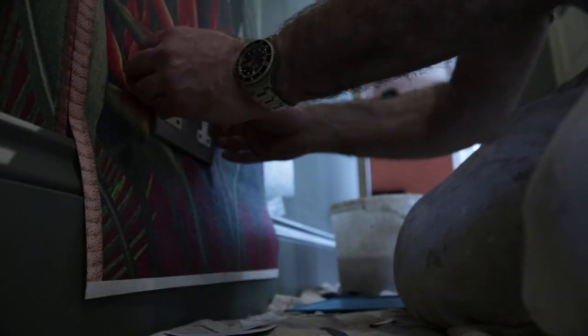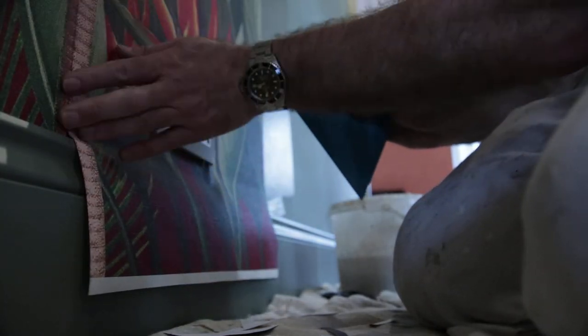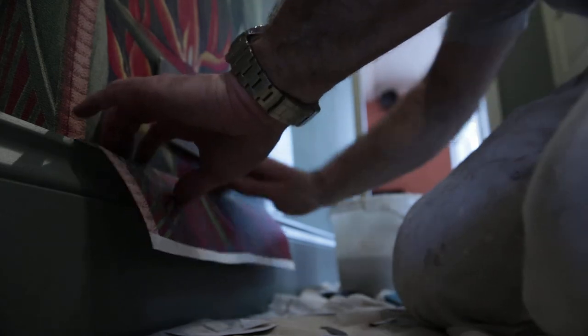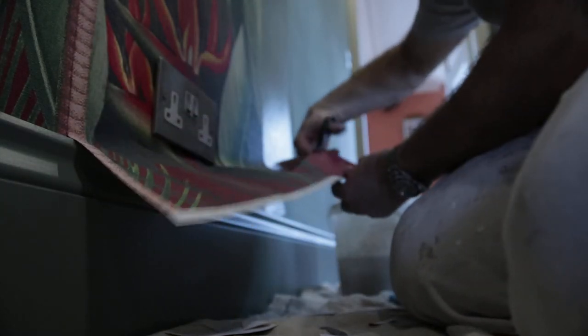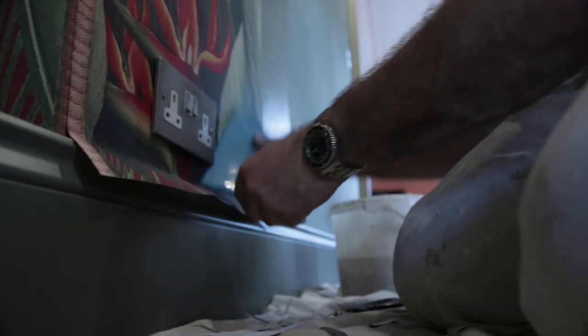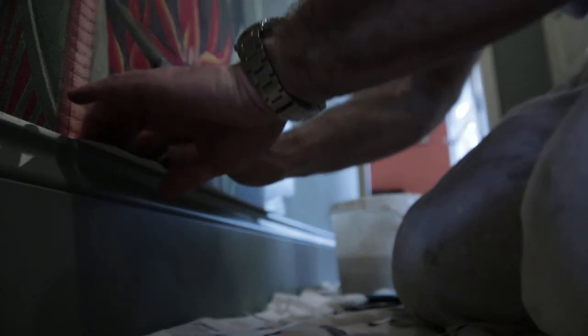Yeah, that's better. So I've got that on. Making sure we're all down at the bottom. The butt joint there is spot on. I'm going to trim that excess off — I don't want any more than I need to be working with. Make sure the paste is at the back of the socket all the way around. The butt joint's good and down on there. I'm just going to push it in with my fingers so I can feel it, then I'm going to go with the blade.